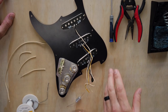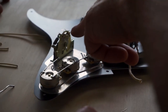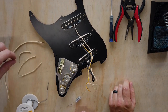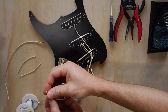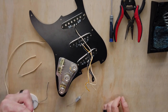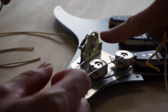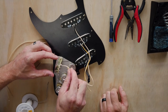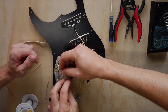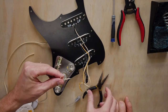So we've got everything transferred over to your pick guard. You've got your pickups ready to solder to it. The first thing you want to do is go ahead and make your connections from the switch to your tone pots and your volume pot. Cloth covered wire — you can push it back and you don't have to strip it, just push it back to where you want it. So your volume pot connection, you want to go to that lug right there. You can loop it to hold it into place. You don't want it hanging around when you're trying to solder it. I can take these pliers and put a little loop in the end.